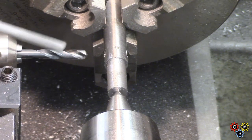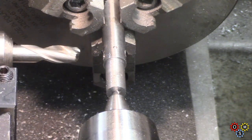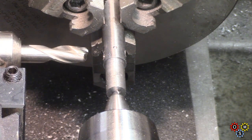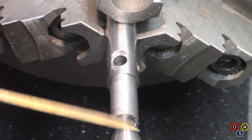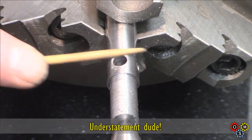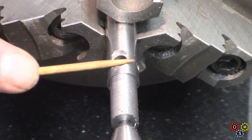Whilst in this position I've got to try and mill a little flat on there, and I don't know whether this is going to be rigid enough — we'll have to see. Yeah, well that wasn't pretty actually. I've got enough relief on there and I can possibly even add a little bit of file if I need to. The milling operation was not highly successful — I may yet have to set that up in the milling machine and take another small bite just to tidy it up.